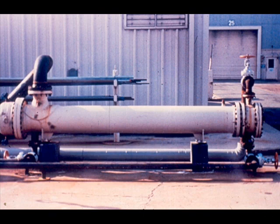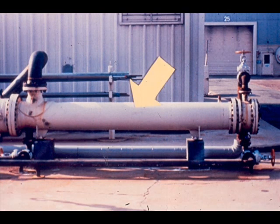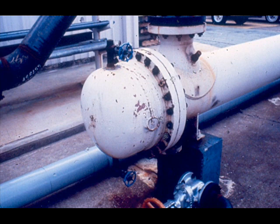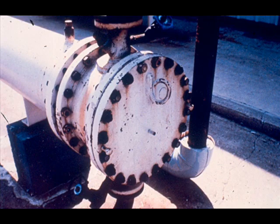The main cylindrical section is called the shell. It has at least two pipe nozzles for shell-side flow into and out of the exchanger. The shell is designed for a specific pressure and must be tested upon reassembling — the design conditions are indicated on the nameplate. This rounded end of the exchanger is called the shell cover; it is attached to the shell by bolts through a flange and sealed with a gasket between the flange faces.